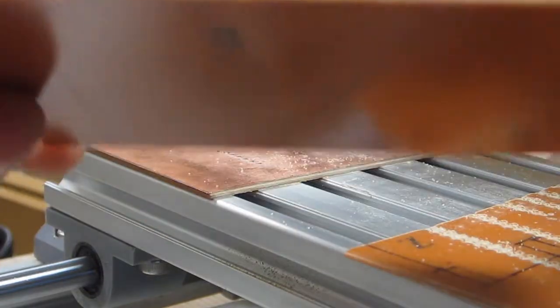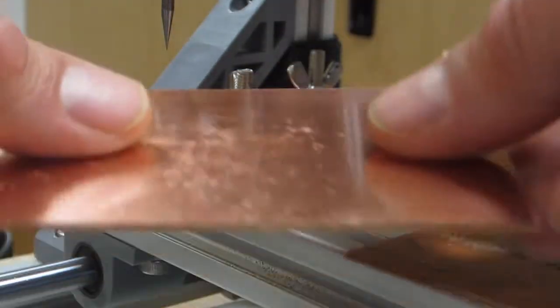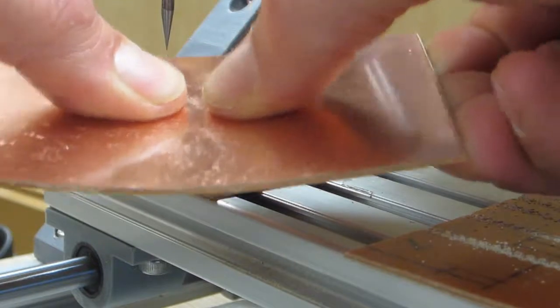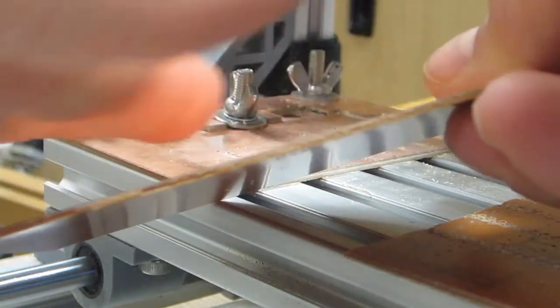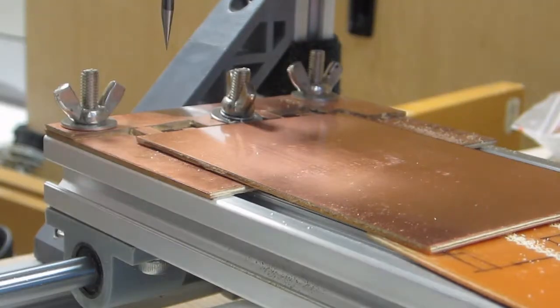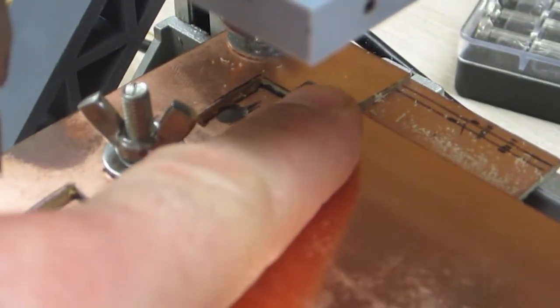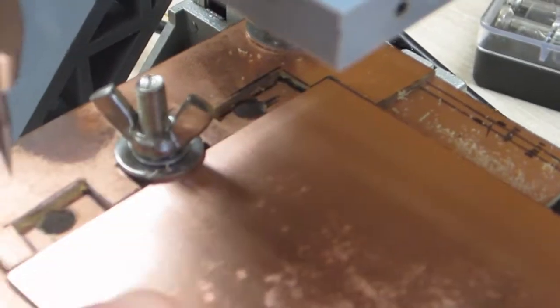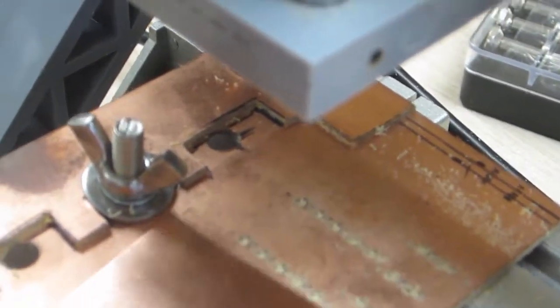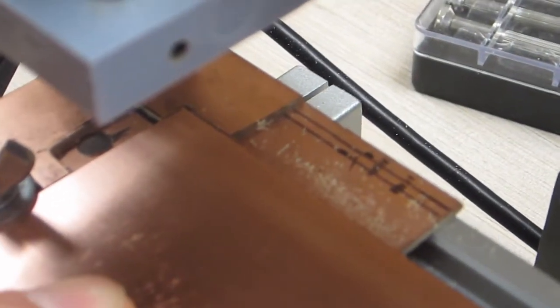If you look at it, it might have a little cup to it, so maybe it's bent a little bit. So what I would do at first is to just take it, and with the copper side up, just give it a little bend, okay, so that it just has a little bit of a wave to it. And then what you're going to do is take this, and you want to get it underneath the washer on this side. So you're going to push it in there and make sure that it's secured or squared right up into here. So I'm just going to take it and again get it underneath there and slide it until it resides right in there.